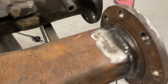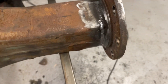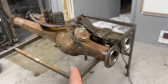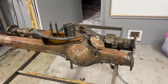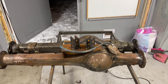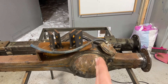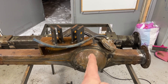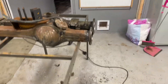I have welded all around this flange so now the rear axle is officially a front axle in terms of width, but with the difference that the housing is now 80 millimeter offset closer to the tire - exactly what I wanted.